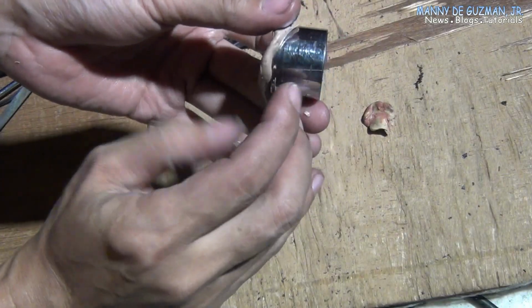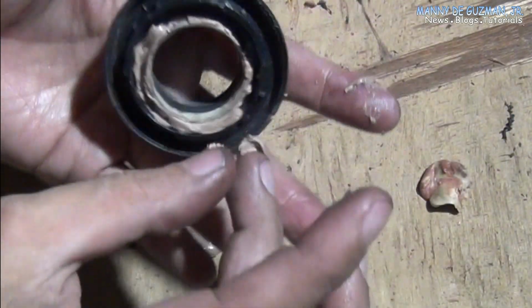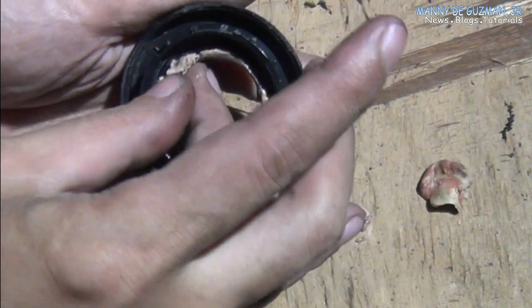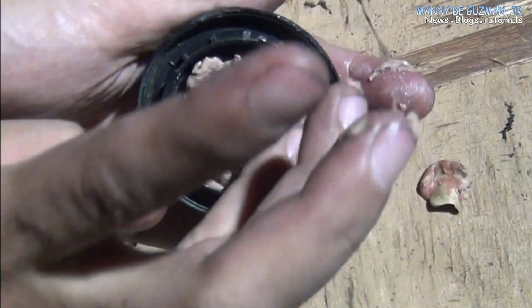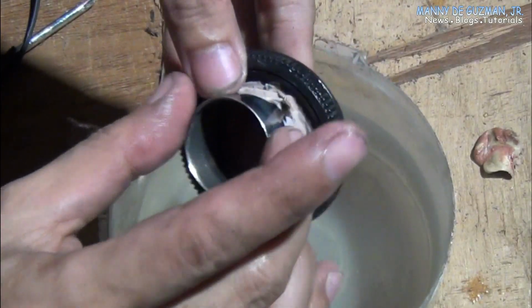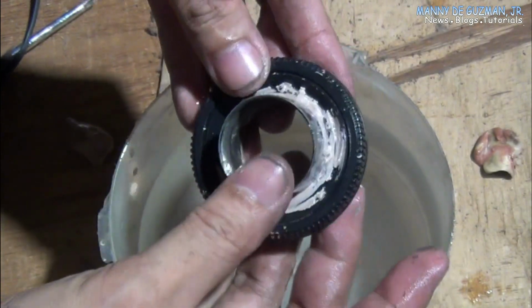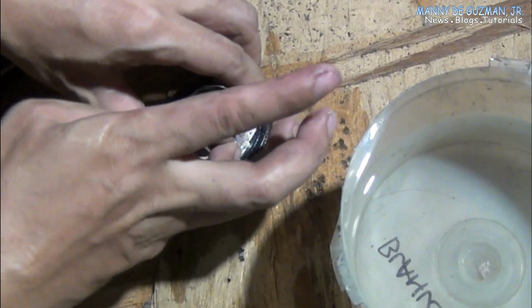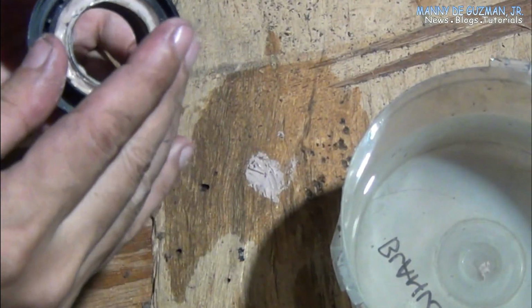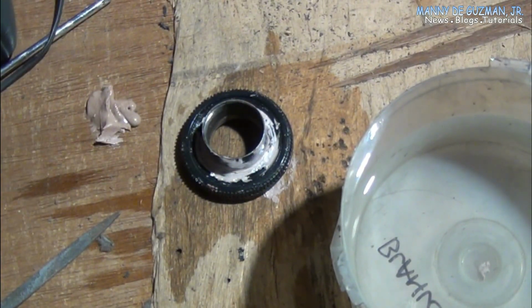Use epoxy to seal any holes and spaces in the joints and to make the fittings sturdy as well. Let it dry for about 18 hours and make sure the band is durable and strong to handle the weight of the camera being mounted on the telescope.